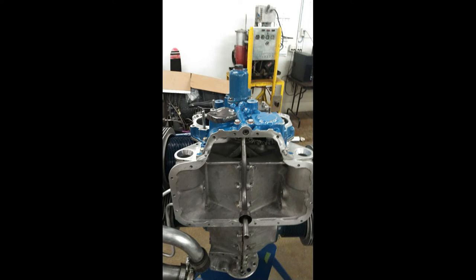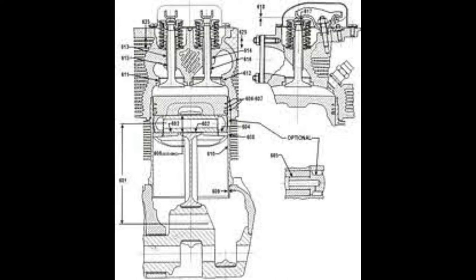So the engine had that going for it, plus for some reason some of the studs were broken, just a completely unrelated thing. Make sure that you check the torque values and that you're actually looking at the right studs and right bolts for those torque values. Most manuals, at least my manual, had a diagram with a picture showing the numbers that correspond with the torque values. Something to pay attention to so you don't break your bolts,